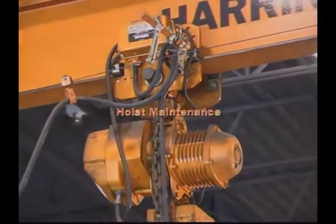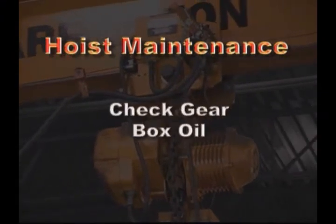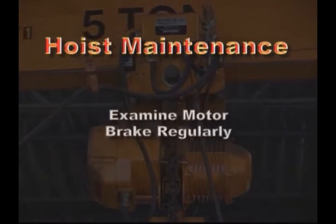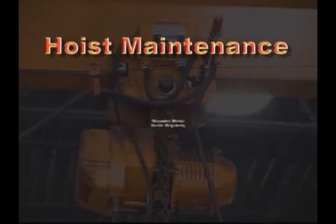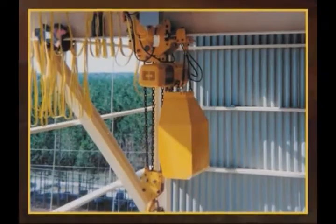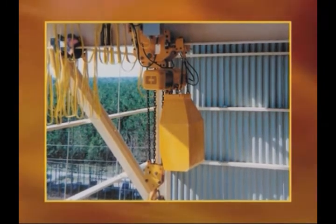Regarding maintenance, check the lubrication level in the gearbox and follow manufacturer specifications to fill or replace the oil. Examine the motor brake at regular intervals as specified by the manufacturer. Doing this will help keep your hoist in top working condition and prevent possible downtime. For optimum performance of an outdoor hoist, follow the recommended procedures of the manufacturer.